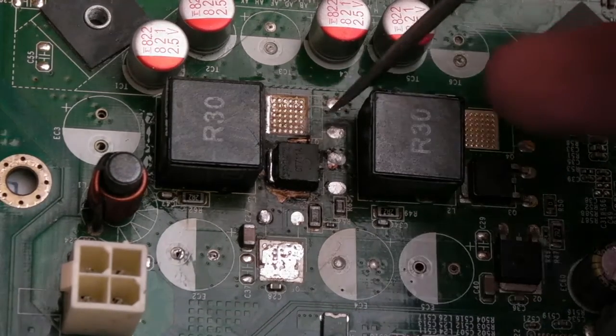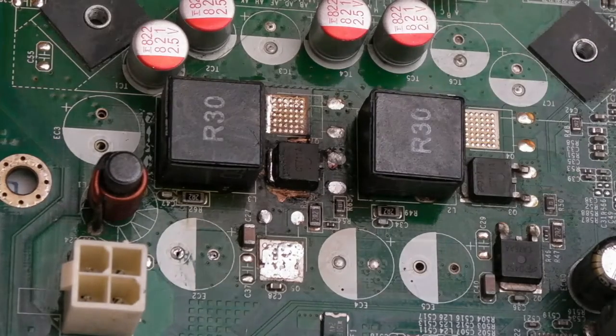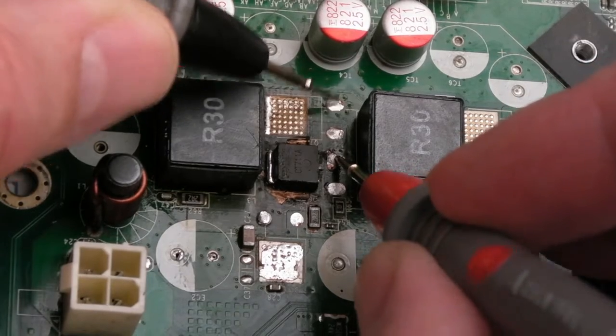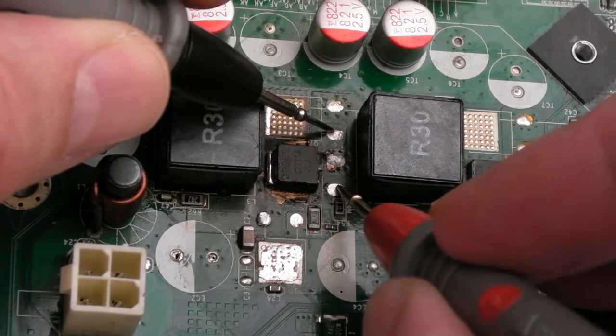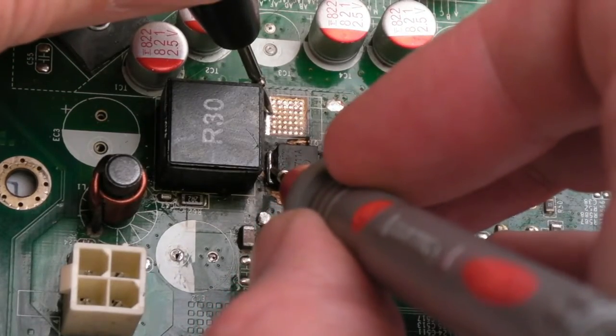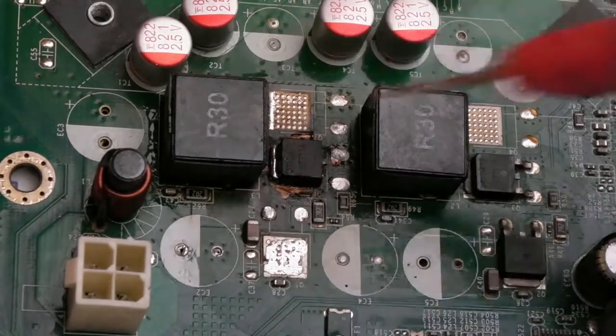But as I showed earlier, these pads here are all in parallel with that. I'll just confirm that now. Cut the pins, but if we test that one to that one, dead short. That one to that one, dead short. That one to that one, dead short. So they are in parallel, and I think this is one of the reasons why a board like this fails,